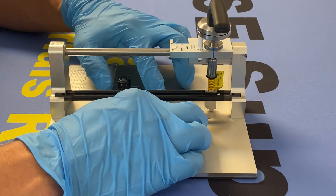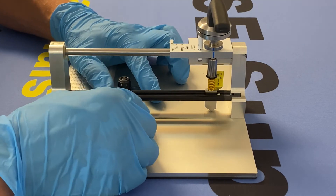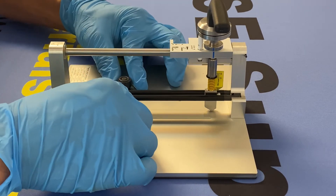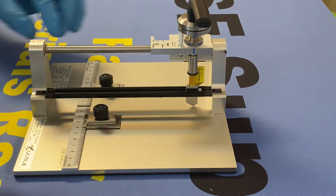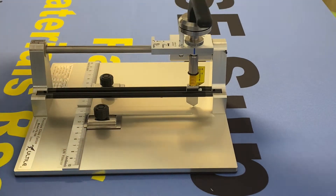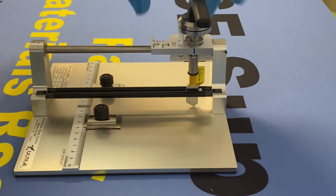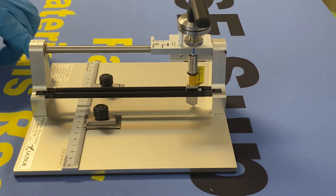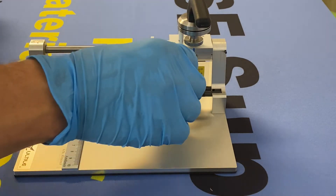This glass is almost too long to cut. Install the second magnetic guide — this is going to keep your material from moving. Once you get everything into place, lock it down. You want to adjust the scale to the thickness of your material with this top screw. Adjust your tension according to the typical cutting pressure for soda lime glass and a carbide wheel.